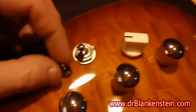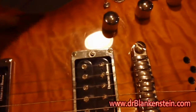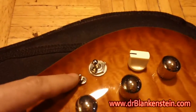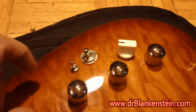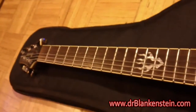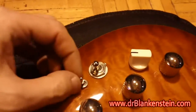So here we are on the front. I've actually reduced this kit down by request by the guy who owns this guitar — he didn't want the motion sensor. As I said in the last video, you may not want that kind of tricked-out thing; you may only be into adding strange, different alternate tones to your guitar. In that case, what I did was put the power switch and the wet-dry switch on one switch. So instead of adding three switches like we had on the Fender — one for power, one for clean guitar versus affected guitar, and one for motion sensor and knob control — we've reduced that down. This knob right here is turning the effect on and off and controlling it. Very simple.